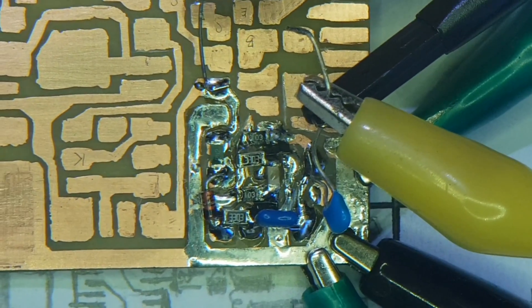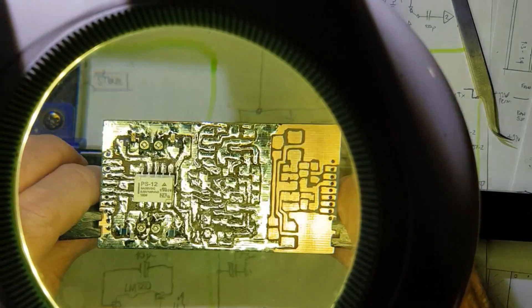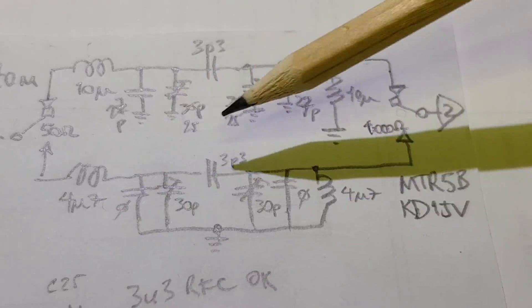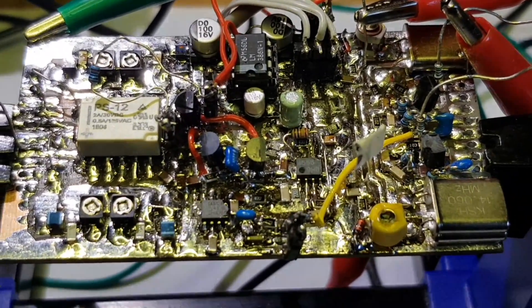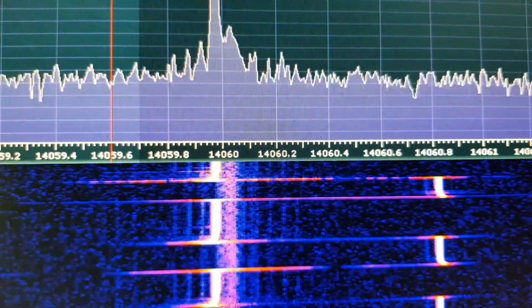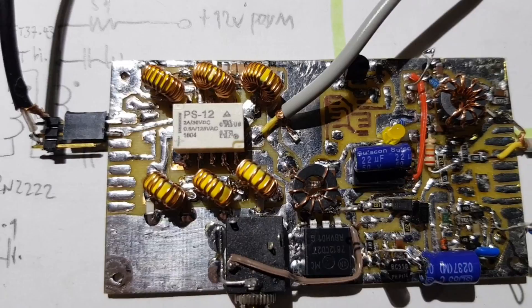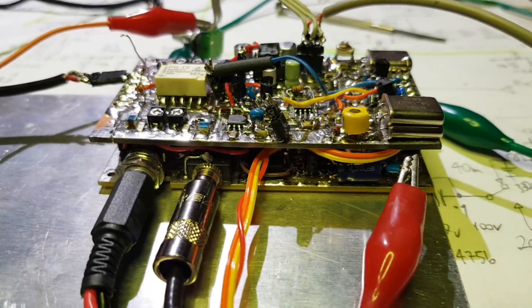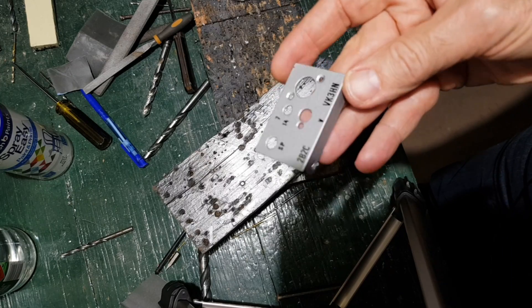After settling on the design of the schematic, I'll talk through the major implementation and construction choices, laying out the printed circuit boards and starting to build them up one module or one part at a time, checking against the schematic, making adaptations where necessary, first building up the receiver, then the transmitter and testing each stage as we go — filters, the complete receiver and transmitter sandwich, the aluminium case and even the front panel.